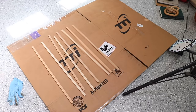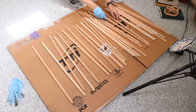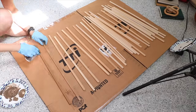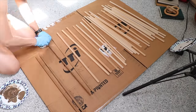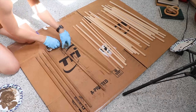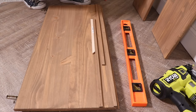This was honestly the longest part of the entire makeover. I have enough sticks to cover the front of the doors and you're going to see the cool pattern I ended up with, but I had to individually stain each one of these trim pieces, making sure it was nice and even on all three sides and the ends since all of that is going to be exposed. It was definitely worth staining these before attaching them.